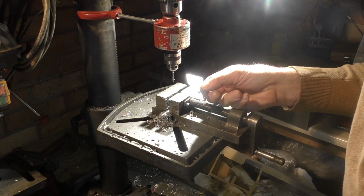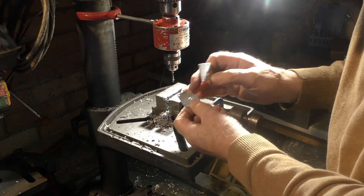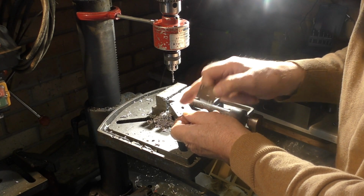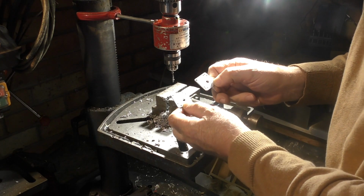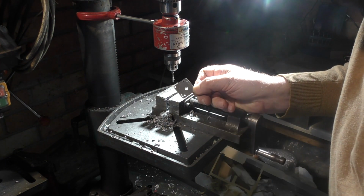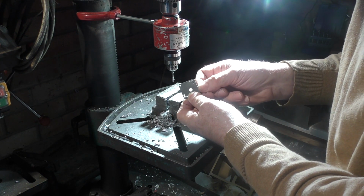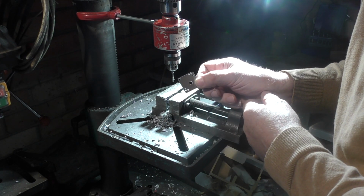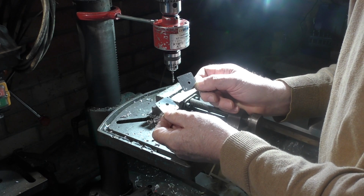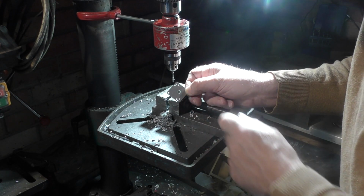At the moment there are two types of mirror holder. One is the standard mirror holder that I use for the Mark II lightweight head, and it has only got two holes in these corners. There's a pair of holes here and single holes in the opposite corners. Now for the mirror holders, I changed the design slightly, and I've put 3 holes in the opposite corners, because sometimes you'll want to have the adjusting screws on the back of the mirror, because that's where you can get access. But because of the K40's limited access, I've put some of the adjusting screws on the front where they're much more accessible. If you're making a CNC version of this, there's no reason why you can't put 3 holes in everything. You can use this on the Mark II head as well as on the mirror holders.